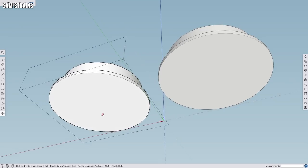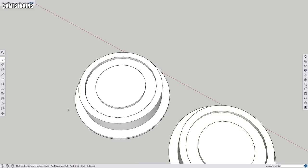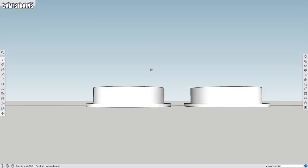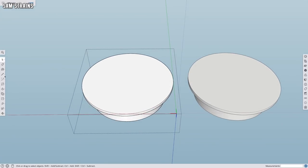So what I'm going to do here is try and just put a hole into these wheels so that I can put a 1mm rod through the wheels. The downside to that will be that there won't be a point on the end of each rod to reduce the friction, but the upside means that I can use a rigid rod which will go through both wheels and hopefully produce an axle that is secure, and it won't take me ages to get the thing to actually work and be level and such.